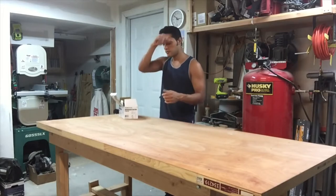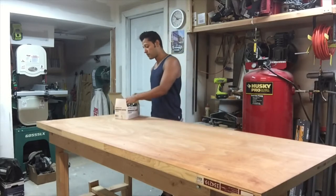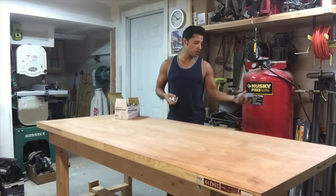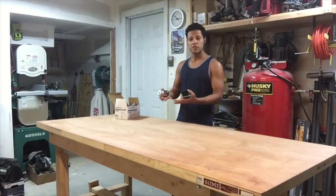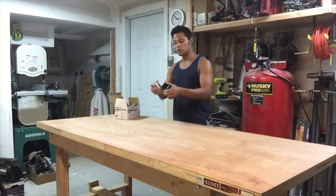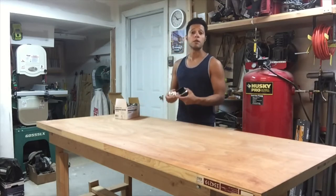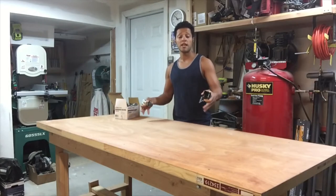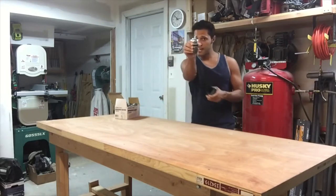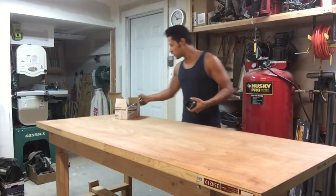It's so heavy and I still need to fold it up and put it away in the corner — I can't just lift it and tip it over. The solution is kind of like what I have on my table saw, band saw, and jointer: you kick up the wheels, that lifts it off the ground, you move it where you need to go, then kick the flap back down and it drops the workbench right back on its legs. That makes it more sturdy sitting on its own legs, and I don't have to worry about shaking, racking, or unlocking casters that tend to tip.